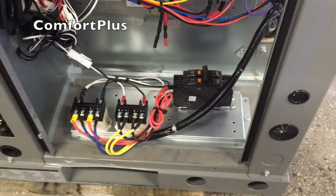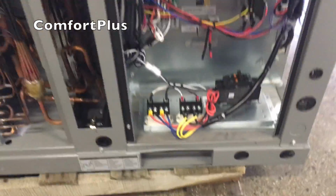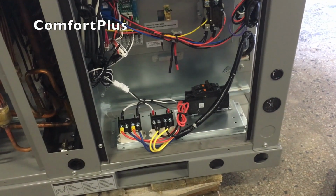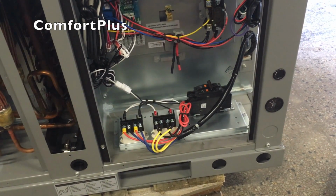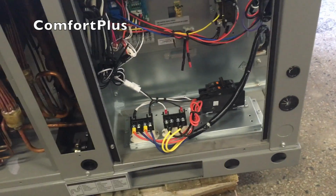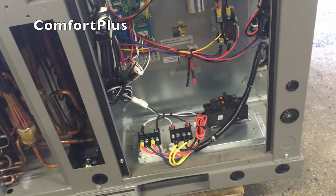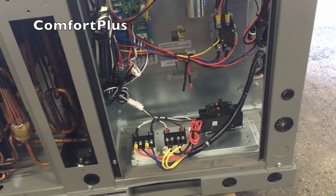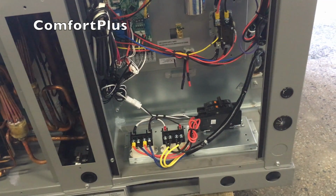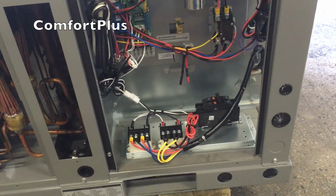This is going on a mobile home that actually has one of the old brown Goodman package units there now, and it has, I guess, about a 100 amp sub panel mounted on the outside that currently has a 60 and a 25 or a 30 double pole in it. So I'll just be able to size the breakers appropriately in that outdoor disconnect and run one conduit from it over to the unit and pull all of my wires through it.